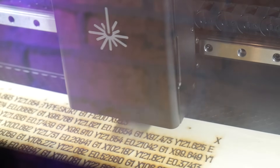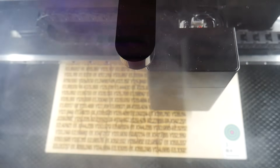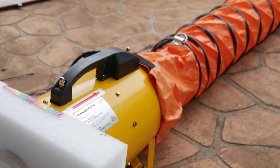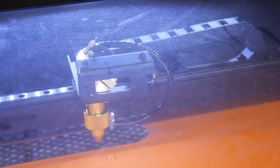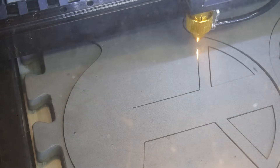And now we're coming to the dangers that concern me the most: fumes and fire. Laser cutters burn material to cut it, and burning materials releases particulates and gases in the form of smoke. To manage this on my laser cutter, I have a huge fan-forced HEPA filter with an activated charcoal layer that is then vented outside. The cheap laser cutters flooding my inbox for review have nothing. The most scary thing about smoke from laser cutters is that you don't really know if it's dangerous or not — even if you do your research, you could very easily fill your room with toxic fumes in an instant.